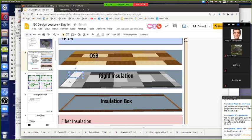And then I guess the next one would be, well, we might have to cut a thin one here because that looks like 4 feet here. If we did this, the next one here has to be cut like this in half so that you're not overlapping those seams. Does that make sense? And then we can go back to actually this full one. Nobody's doing it right now, but for whoever takes a look at this, that's what we need to do. So now it's back to a full sheet again here, and the pattern is just that no seams overlap, that's all.